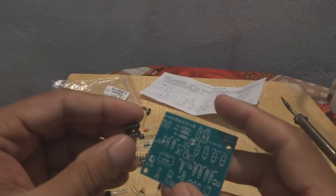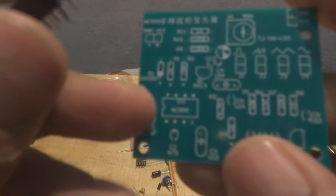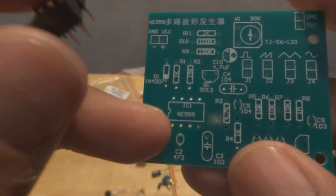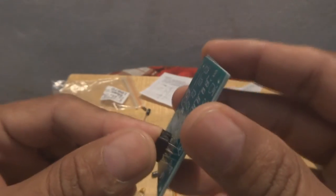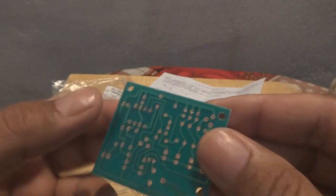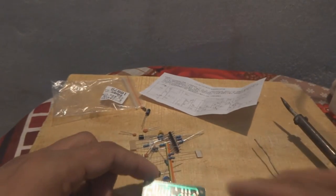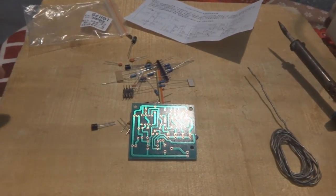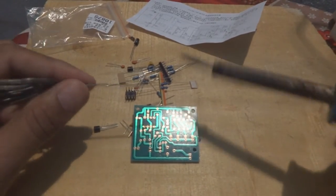We will start from this. And here is the notch for this IC. The notch is demonstrating that the pin 1 side is downside. There is also a notch in the socket, so I have to put this notch down and align it with the notch on the silkscreen. Like this, I have to put the socket in first, and then we will solder it. So here I'm going to solder this IC socket first.